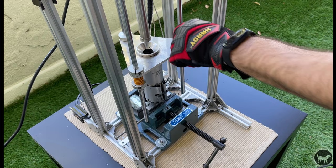As you can see, the PLA fills the mold quite nicely, and rather than seeing the 3D printed lines anymore, you have a solid object that is much stronger and much finer detail than I could ever get on my regular printer using PLA. And finally, for the polypropylene, I have this little knob that was used on the original Buster Beagle 3D injection molding machine. It works just fine, and now any extra runners or sprues I have from these new parts can go back into the process to shred again and use for another part.